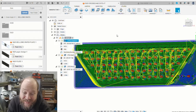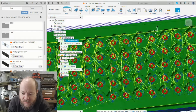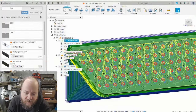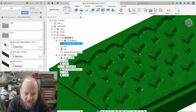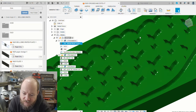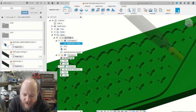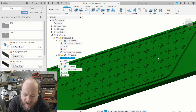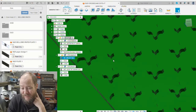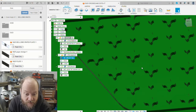So I have a 1/16" end mill come in and do the roughing out. You can see how rough it is — it's pretty rough after the 1/16" end mill, but it tries to get as much material out as it can. Then it comes in with a 1/32" end mill, and it gets a little cleaner, but it's still not quite there. Hopefully that 1/32" end mill won't break — it's obviously a very fragile little end mill.